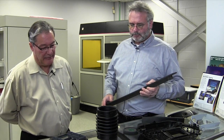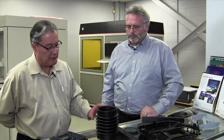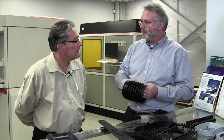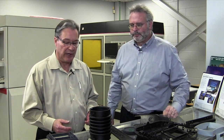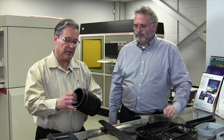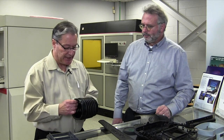No, you can't. They're making some advances with 3D printing and additive manufacturing, but the actual urethanes do not come off printed machines. Typically you're going to get better material properties with urethanes, and that's one area that really drives people to using them. A good example is that rubber bellows — the customer needs a functional part in rubber with good memory and good tear strength. While we can build some parts in rubber materials with 3D printers, they just don't have the quality you can get by casting a part from urethane.